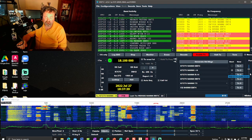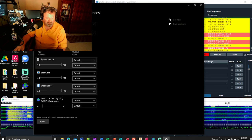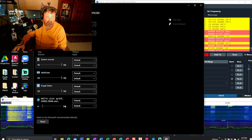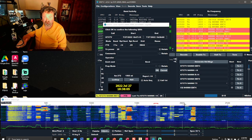I've got my ALC settings — it's a balancing act with the sound card. I've got my master volume on my computer at 50, and then I adjusted the WSJTX volume to 9. It's very touchy. On the radio itself, the R port gain happens to be 9. That just worked out for me. Log another one — there we go.